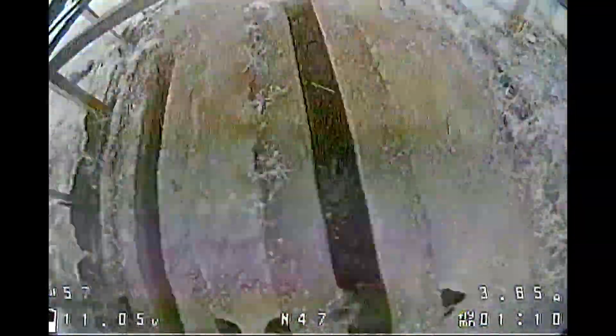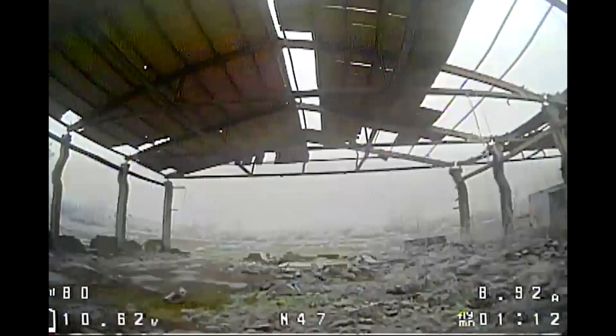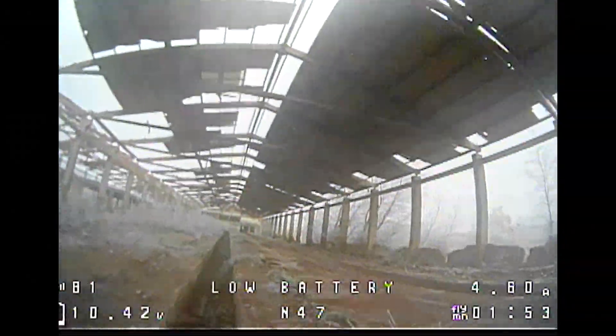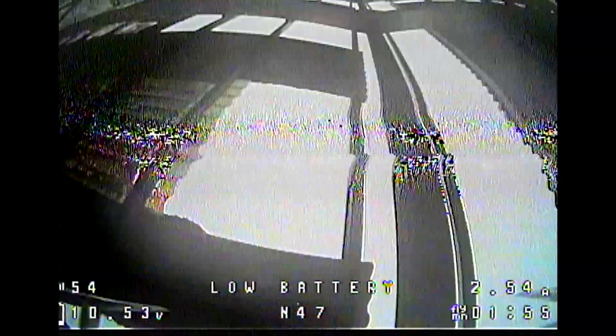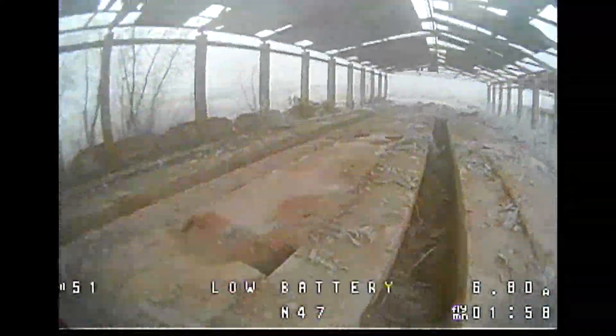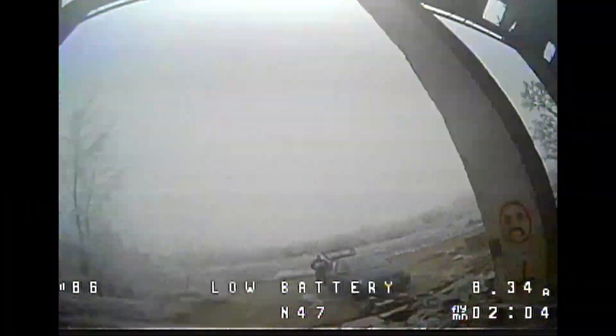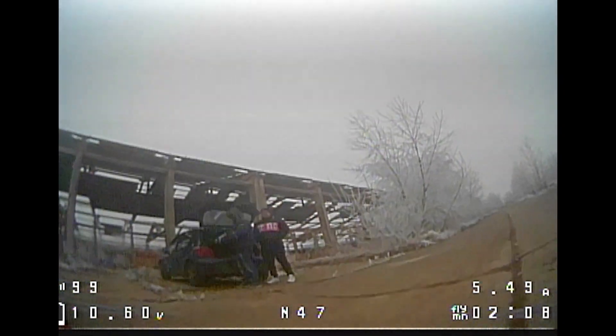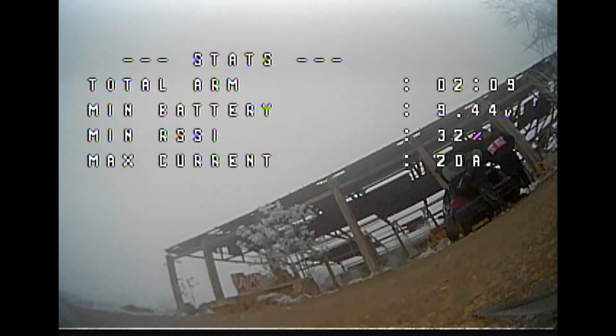If you take a look at some of the flight footage, since everything is foggy and white, we can see slight noise lines — like vertical lines — and I'm pretty certain those are from slight electrical noise. However, it's not making its way down to the gyro. But if you were to purchase this and wanted it to be your daily driver, I would definitely recommend adding a small 120 microfarad or 220 microfarad low-ESR capacitor on the battery rails, which will increase the overall lifespan of the components on the boards.